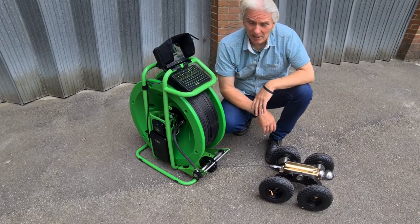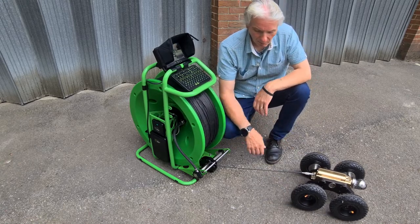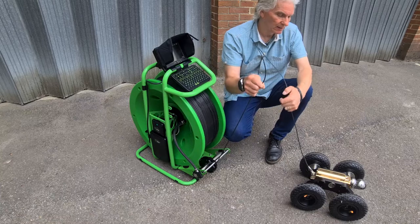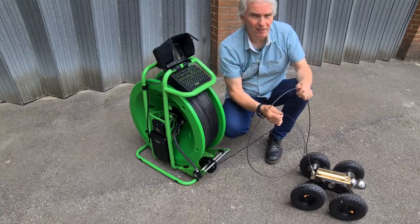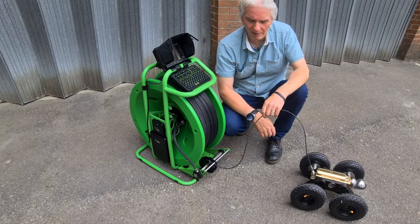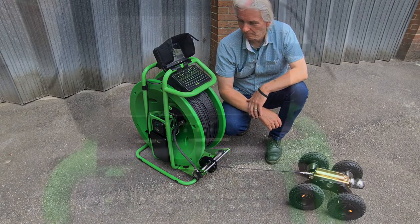For a situation like putting it into a culvert, that's no problem at all. We can just push the crawler around and the auto drum will let cable out. You can pull cable off the cable drum and it will motorize it back out again. Use a lowering device to lower the crawler into the culvert, and when you let go of the cable, the automatic drum will pull in the cable until there's a small amount of tension on it, then it will stop — and we're ready for use again.